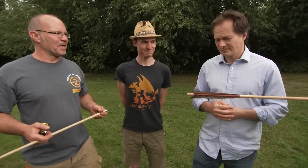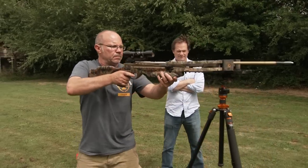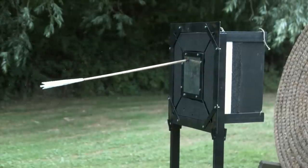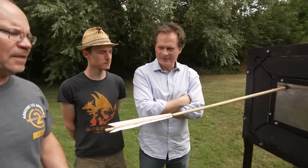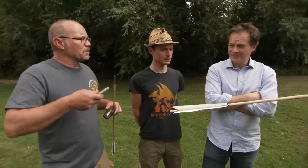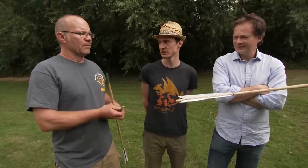The next test is carbon steel — the higher end of what they could do — and we think we'll probably see something quite different. This is a modern medium carbon steel, just like we used on our breastplate last time, and it would equate to really quite high-end armour. I wasn't expecting that. The arrow head is actually showing through — measuring five and a half centimetres. It is a big difference, but equally it has penetrated. Of course, this material is not heat treated — it's annealed, as soft as this material gets, and not shaped. It's almost half the penetration depth of all the other materials.